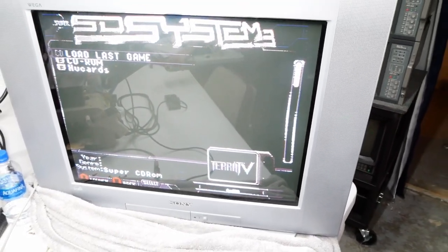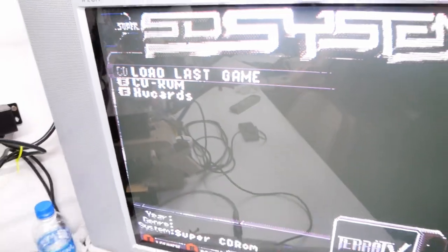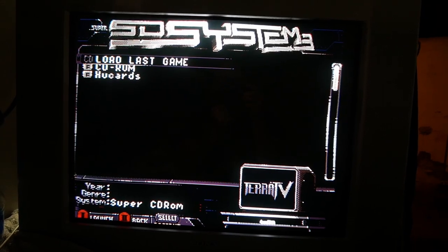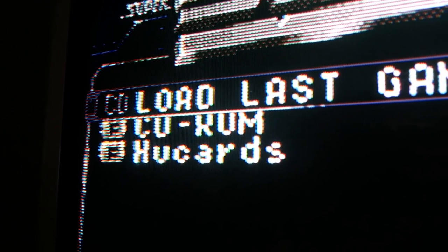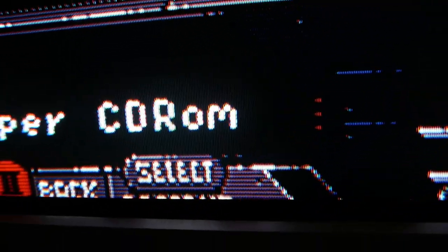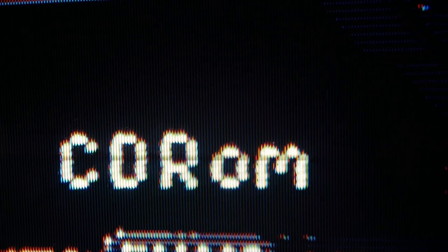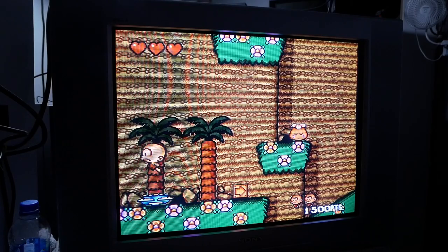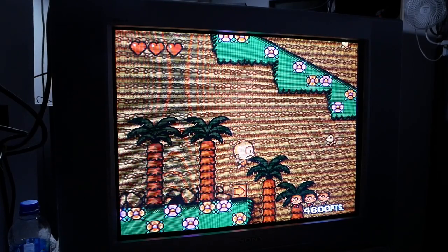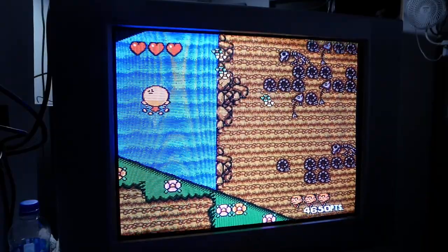I was not happy to see that my geometry went back to crap — I guess sitting for a year in the garage or me removing all the capacitors just reset it, even though I had it tweaked in and saved. I still got that shimmering, dot crawl, ringing, h-sync jitter — whatever you want to call it. This Sony suffers from it; it gets worse as I turn the picture or contrast up. Here's some Turbo Graphics Bonk's Revenge footage — looks pretty good, but it looked the same before the recap. I was really hoping to alleviate some of that ringing, but it didn't help, unfortunately.